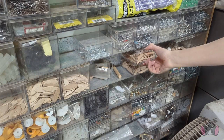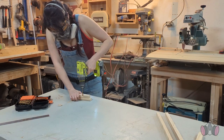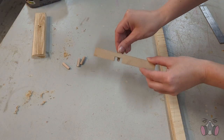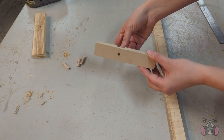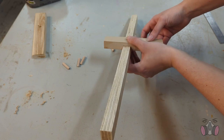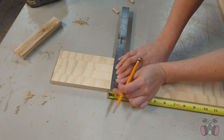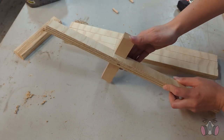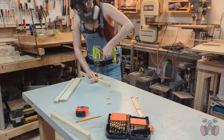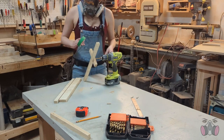The last thing was to grab some oak dowels and then drill a hole in the center of the groove on my jig that's big enough for the dowel to fit. And this is how it looks in the end — I can fit the dowel in, there's enough room for the glue to also get in, and when I put the jig on top of the strips, I know that every time I drill through that hole it will hit the exact spot every single time. I just have to make sure that the strips are lined up exactly — I measure out how high I want the cross section to sit on the legs, draw a straight line across, line up my jig with that line, and drill there. After drilling the first hole I made sure it was the right depth, and then I put some tape around the drill bit so that I know exactly where my stopping point is for each piece.